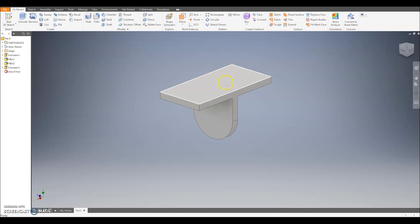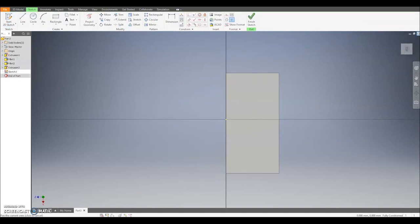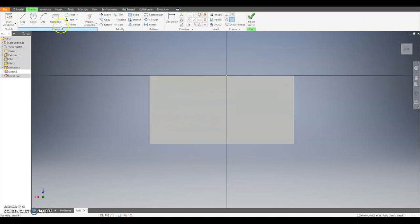We're now going to do the pelvis connector — this is the top part that goes into the torso. So to do this we click on the pencil once more and select the top surface, turn it round by clicking on the arrow just so it matches the drawing. We're going to draw a rectangle shape; the rectangle I want to draw is going to be 12 by 6. I'll draw a rectangle roughly the right size, then type in 12, tab 6 to get the correct size. Then I'm going to use the dimension tool. I'll click this line here and the edge of the model and click once more.